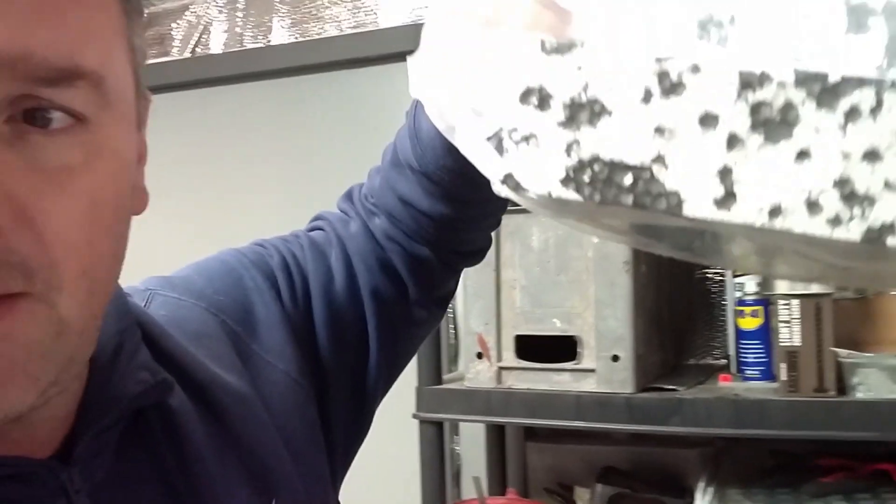Okay so the ceiling — I've just put up that kind of bubble foil. Can you see it? It's this kind of foil side, and underneath that is 50mm polystyrene insulation sheets. So I've basically put that up and then put the bubble foil over the top of it. I'm going to board it next year, but I was so tired and so sick of doing the build I just couldn't be bothered with it. Because it's a metal ceiling, I haven't put any wood up there — I've had to attach it with mini magnets. And that is what's holding that up there, amazingly — plus the tape obviously. It remains to be seen how warm it's going to be in here and how well that holds the temperature.